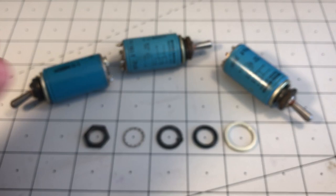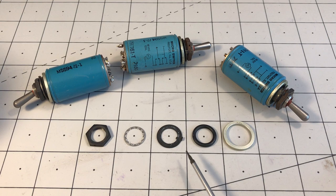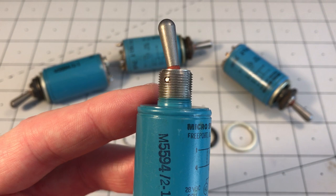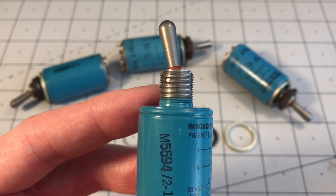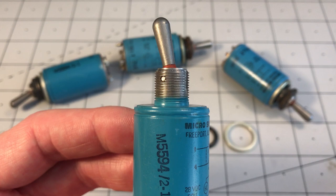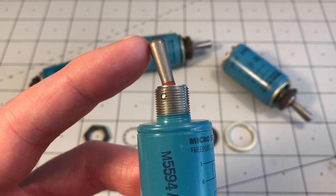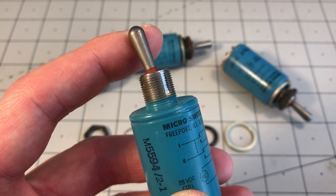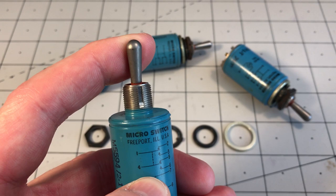Here's a closer look at the switch. I've already removed the metal ring, the O-ring, the keyed washer, the locking washer and the hex nut from the switch thread. The nut has a hole for a locking wire. The thread is now exposed — it's a 15/32 inch thread, about 12 millimeters in diameter, and it will go nicely into a half-inch hole. The height from the top of the thread to the end of the toggle is 17 millimeters (0.7 inches). When the switch is in the off, de-energized position, the toggle is opposite the keyway on the thread. When switched on, the toggle moves towards the keyway — that's the orientation of the switch action.